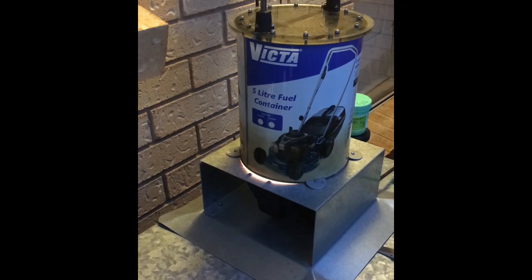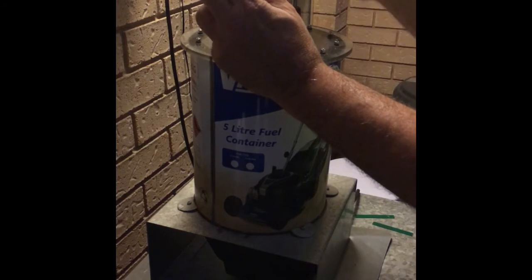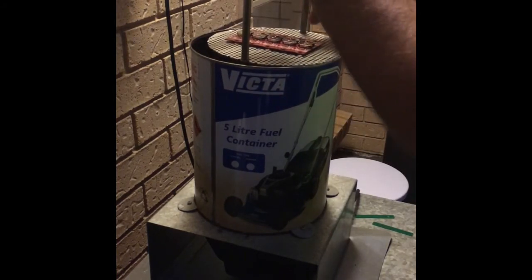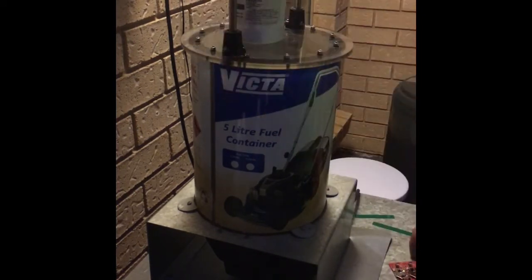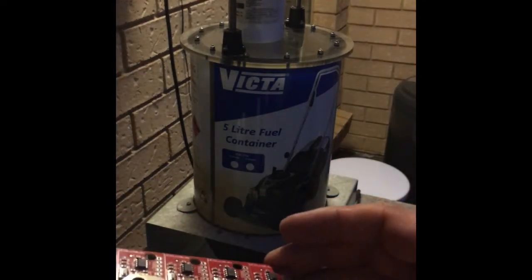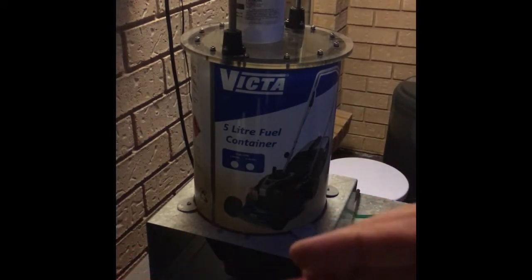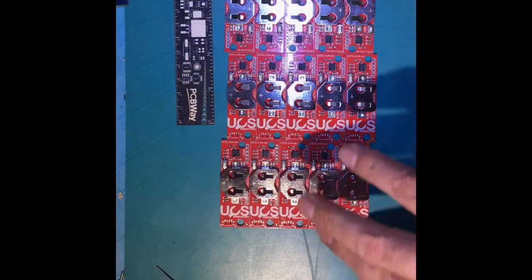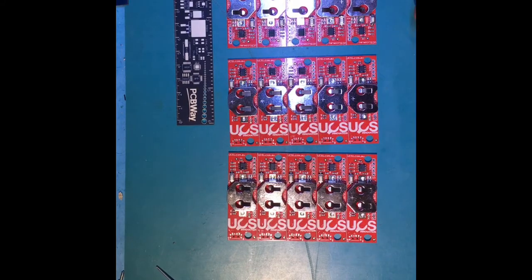Power on, 10 minutes. Okay, cooking is done, cool down is done — let's see what the board looks like. The light's a bit bad so I'll take it inside. Welcome to Australia — there's always something trying to eat me alive out here. Okay folks, evaluation time. I've loaded all five panels now — three of them perfect, no tombstones.